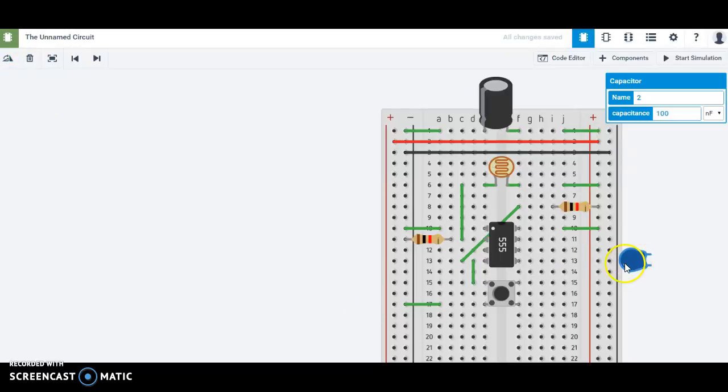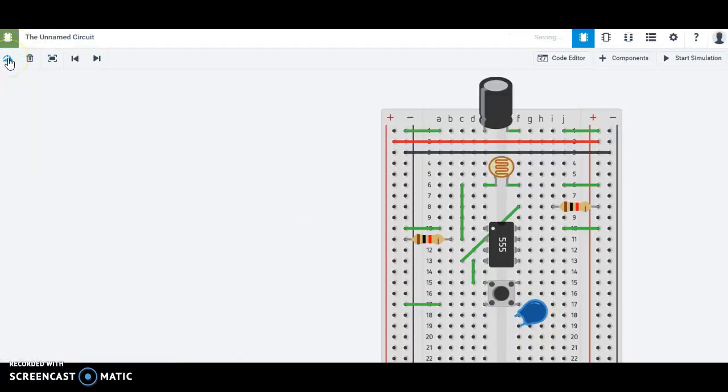So I'm actually going to spin it like this, and I'm going to put it below my switch. So it doesn't even come close to it. And I turned it this way so that it's not interfering with my sight. I can see all of the breadboard just fine. Otherwise, if I were to rotate it like this, it's kind of in the way of the breadboard. It still works, but I'm going to make it easy on myself. All right, so remember you need to make sure that the 2 pins are in separate rows because otherwise those pins are short-circuited together. All right, so you want to put it like this. So I put mine on row 18 and row 19.